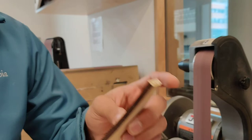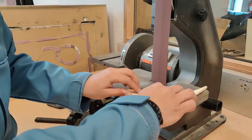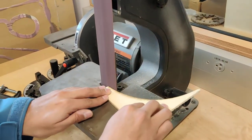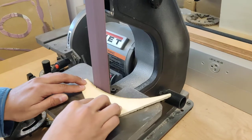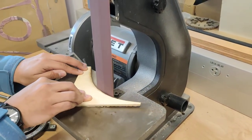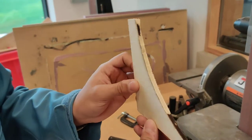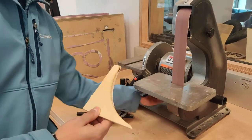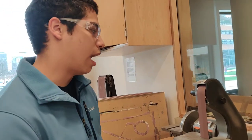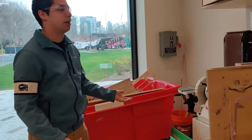And just like that, we've smoothed it out. For trying to smooth out curves, you can use an angled approach, and we got most of the burn mark off. You can just keep going where it's needed more. For a bunch of other angles, you would probably want to use the oscillating spindle sander. And for giant pieces of wood, again, you would want to use the belt sander.